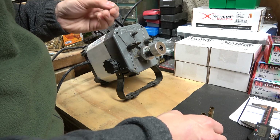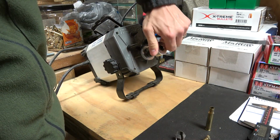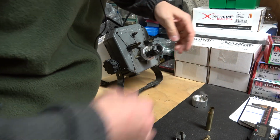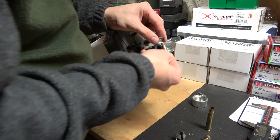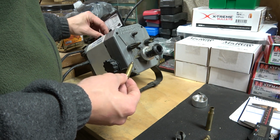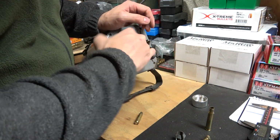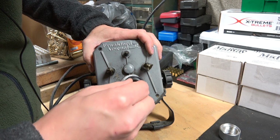And then we'll grab a shoulder stop. And this one looks like it's going to work just fine. So I'll just pull this off. And we got some brass shavings in there, that's okay. I'll use a 223 case to pull out the shoulder stop that I was using for it. You can see it's quite a bit smaller there and sits against the shoulder of a 223 case. So I'll put that back away, as well as the case squeezer thing. Let me get the brass chips all brushed out of this mouth opening, and that should be good. And then I'll drop in the shoulder stop.